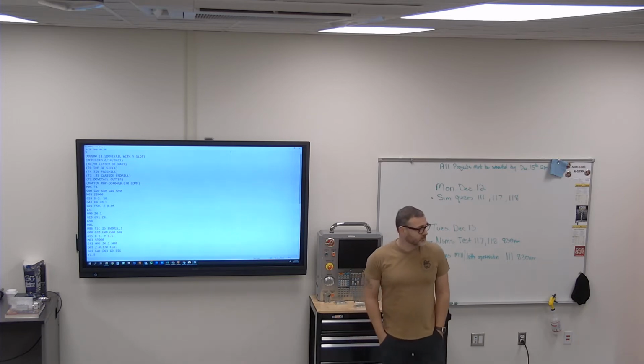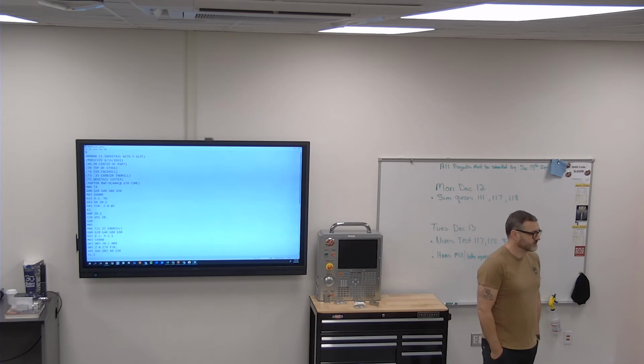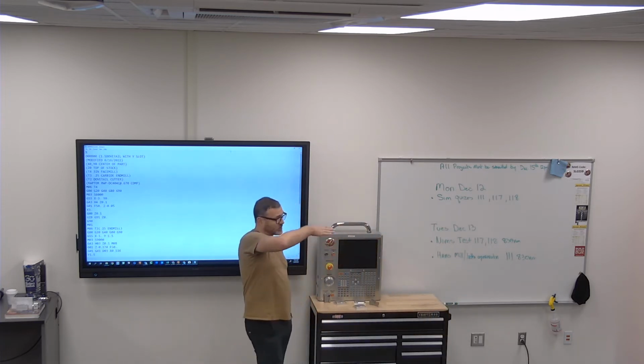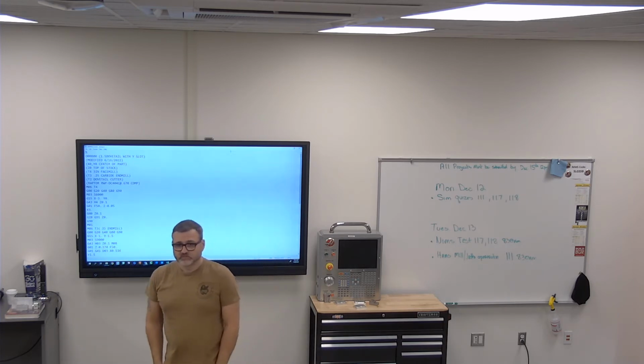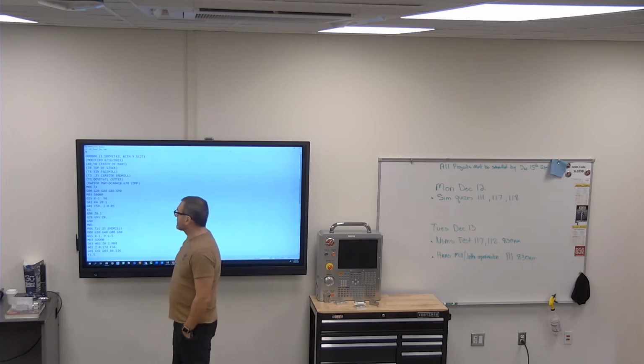Normal end mills come out to 6,400 RPM and 64 feed per minute. Do you still feed the same with the ball mill, or does it change because of the ball mill? It will have a little more contact because it's radial on there. But for what you're doing, I don't think it's going to make any difference. Yeah, tool 3, you've got your tool 3 there.